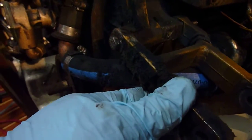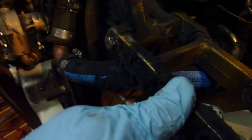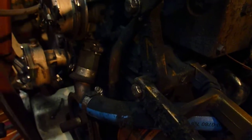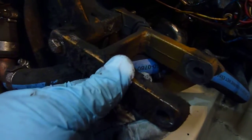It's kind of dark in this boat that I'm working on, but you've got about an inch there and it's become loose over time. What happens is the bracket tends to cock off to one side and then the belt wears unevenly. This is the owner's third or fourth belt in just one season due to this issue with this older style bracket.